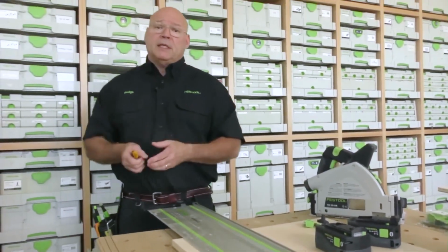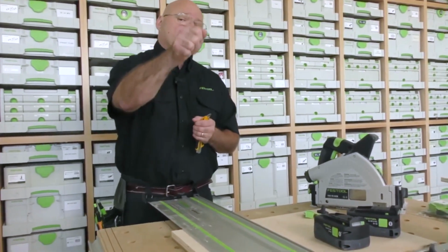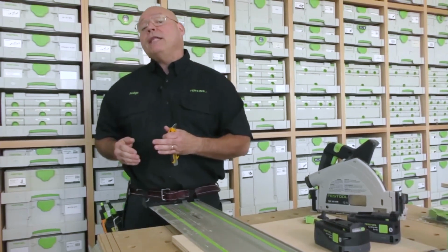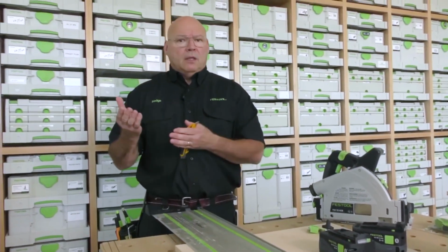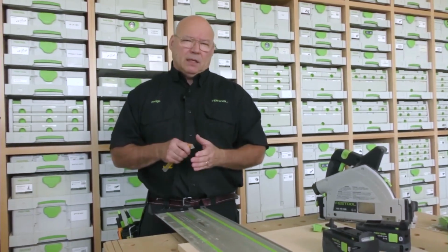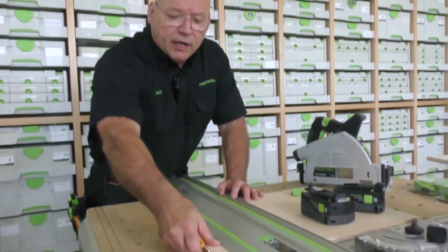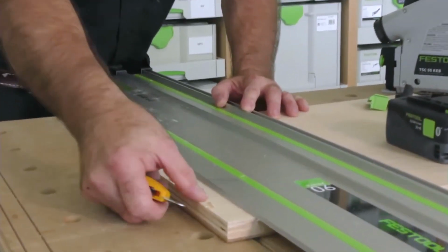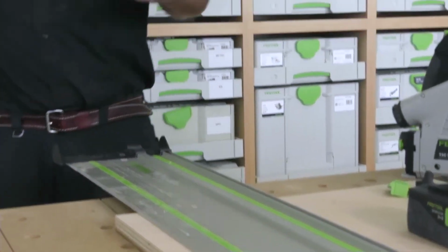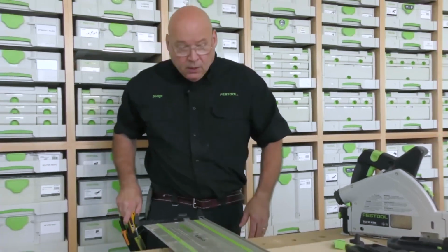And it would work pretty good, because I'd take some blue tape and put it on there. And then I would cut my line that I knew it was going to cut to the inside of my blade. Because I didn't want to break the veneer or cause chip up. Because if I use just a regular saw, that blade's going to come up and chip that top veneer. And everybody knows that top veneer gets thinner every week from the manufacturer of the plywood.